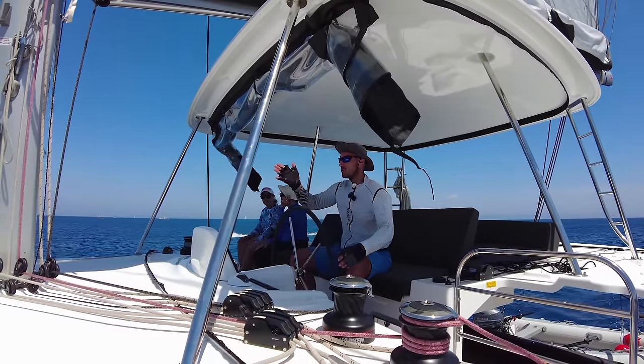Now we're going to put the line to the boom. If you don't put this line, which most people don't do, then the boom is going bang, bang, bang, bang on the waves all night. So what we do is we just attach this rope.